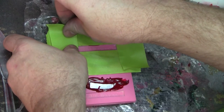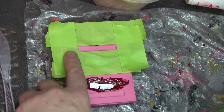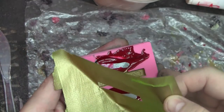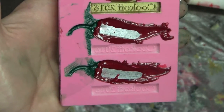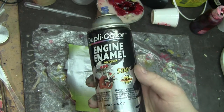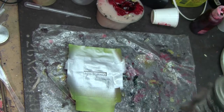I have Dupli-Color gold and Dupli-Color aluminum. I'll be spraying right into the mold so that when the resin goes right on top of it, it'll bond really well and come right out pre-painted. So I sprayed that with gold and that should look pretty decent. I'm going to remask the middle one and paint that aluminum colored — which is silver, but they call it aluminum. The silver is now painted. This is an aluminum engine paint from Dupli-Color rated at 500 degrees. One of the reasons I really like Dupli-Color is they cover really well and they cure really fast.